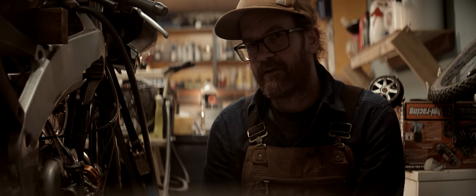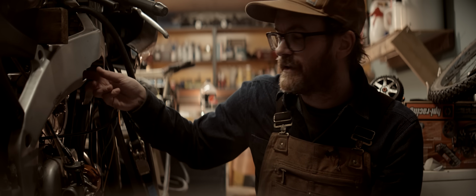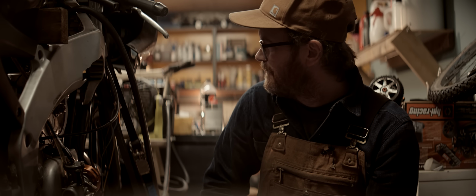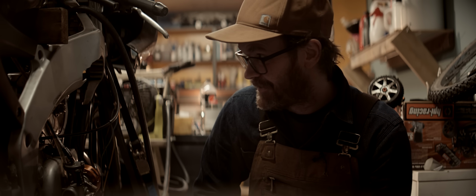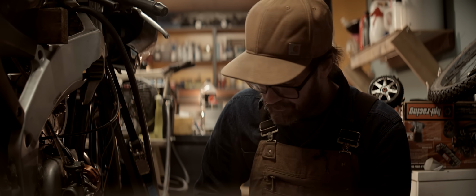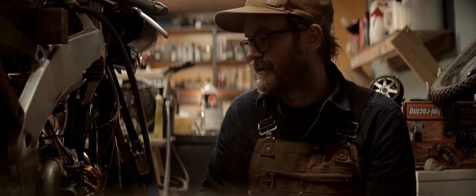We're talking 90 degrees of communication between the exhaust port and the transfer ports. 90 degrees. I might have to steal those wrist pin caps from the Fritz Overmars concept engine or make some myself. That could be our problem. I think short-circuiting is our problem regardless if it is the wrist pin or something else.